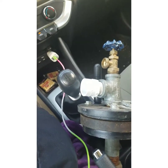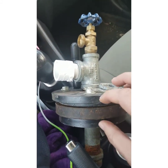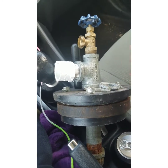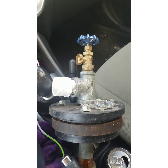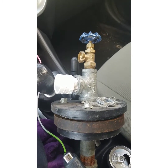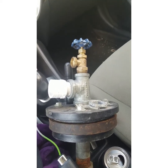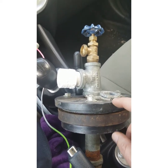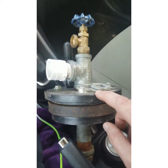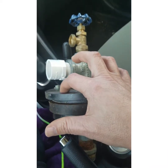A lot of people don't know about the ABS plastic well seals. I would use those for a shallow well or maybe just a couple hundred feet. When you start going deeper, the heavier and bigger your pump is going to be because of the depth of the well. There are steel well seals too — they're made similarly, but some of them are split on top rather than solid like this one.